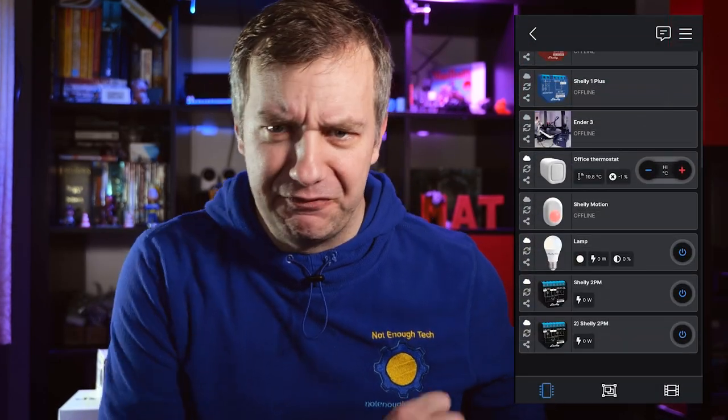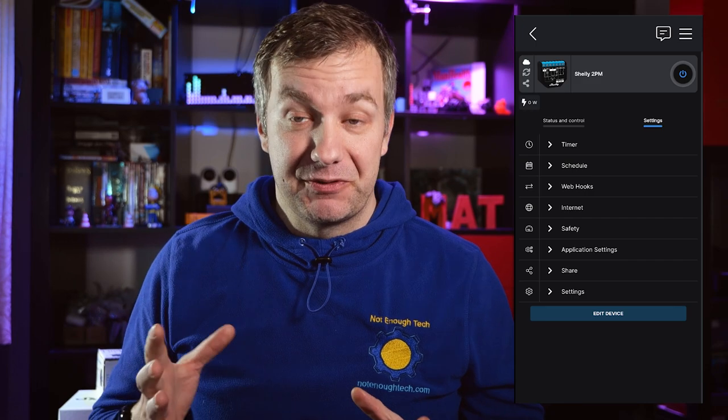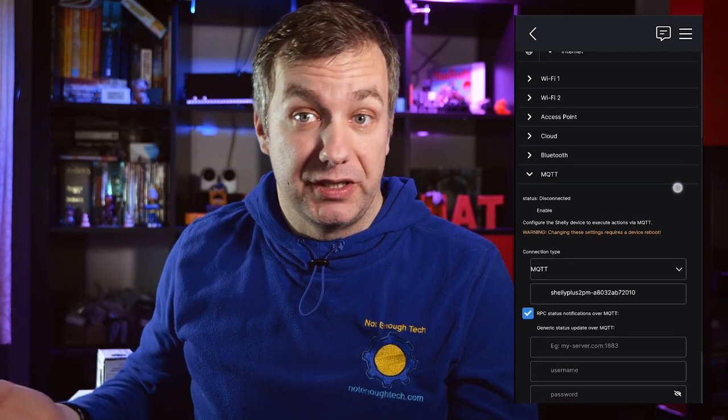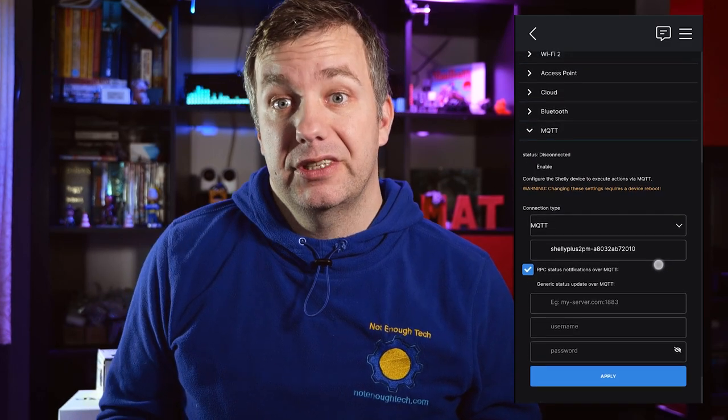But what's most important in the Plus series are the new features. In my past video, Shelly vs. Sonoff, I outlined a couple of things I would like Shelly to change to make a better competing product, and it seems they took some of that on board. We have really super cool exciting features. First, for the first time, you can run MQTT alongside the cloud. Previously you would have to either select MQTT and connect that to your Home Assistant, Node-RED or similar, and give up the cloud. But now with the Plus series, you can take advantage of MQTT connectivity and retain the device in Shelly cloud just as a backup.